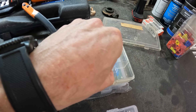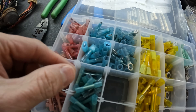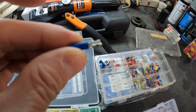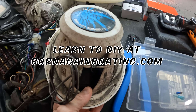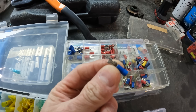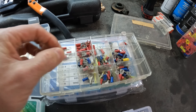The only exception I could ever come up with is for something like a heat shrink female spade connector, because it is very difficult to find a heat shrink spade connector in a small style. If you look on the back of a speaker, most speakers are going to have a real small spade connector like that, and that is the only time you would want to use something that is not a heat shrink on a boat. Other than that, I would probably throw all of this away — you should never use that on a boat unless you are looking to have a problem.